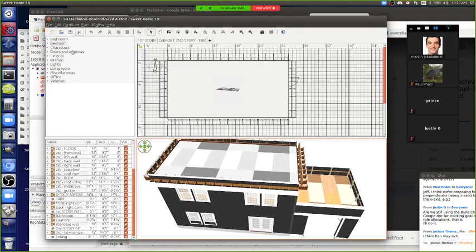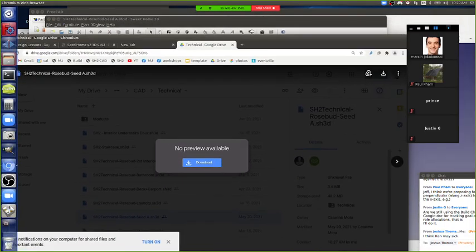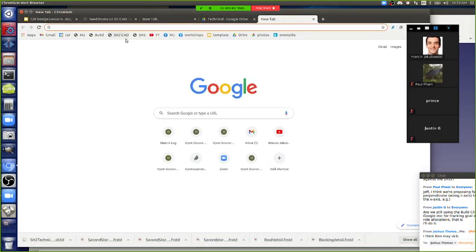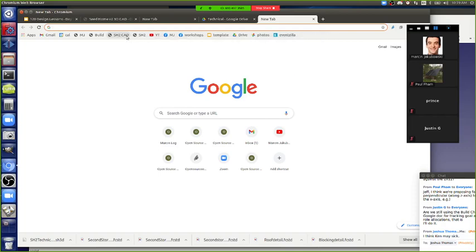And then if I do that, the roof would need to be R49. Mm-hmm. Let's look at our bill of materials, what the actual numbers are there. You need 49 there? Mm-hmm. 49 on the roof if I have 25 on the wall. Sorry, what's the roof requirement? 49 if the walls are 25. If the walls are as low as 23, then I would need an R60 in the roof.